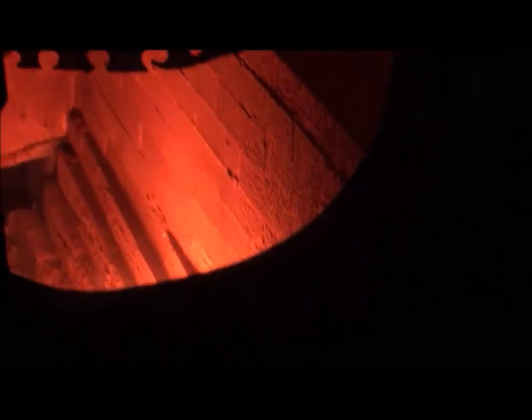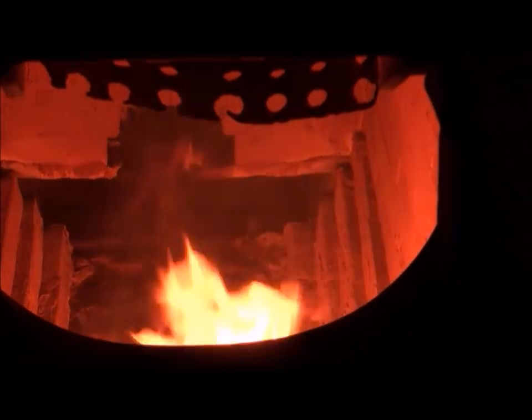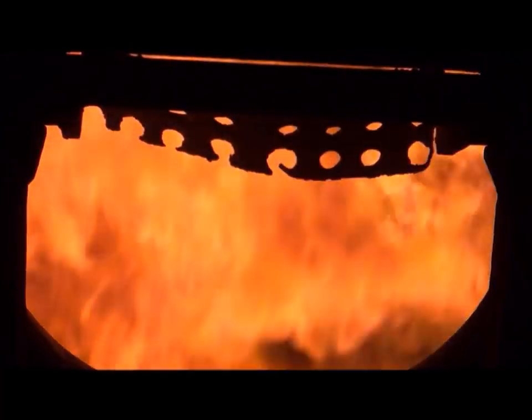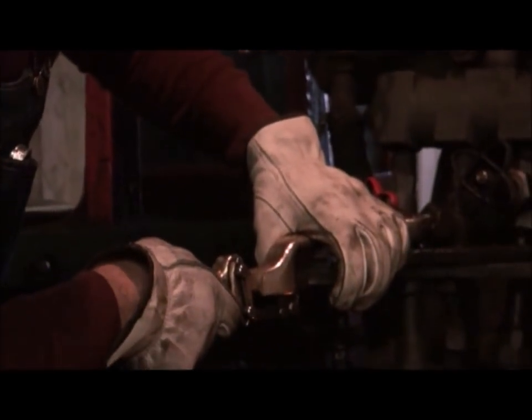You want to make sure there's pressure in the boiler, water in the boiler, and then blow out your atomizer and your blower to get all the fluid water out of them. Check and make sure you have oil and that your damper oil is open, because if you don't have oil, it's not going to work. Now it's time to start thinking about starting the fire. There are a number of different things you can put in there to burn — we like to use plain old newspaper, some people use cotton waste. Get a good fire going on a piece, toss it in. From there, open your oil up just a little bit — not too much because we don't want a big pan fire, a lake of burning oil in there.